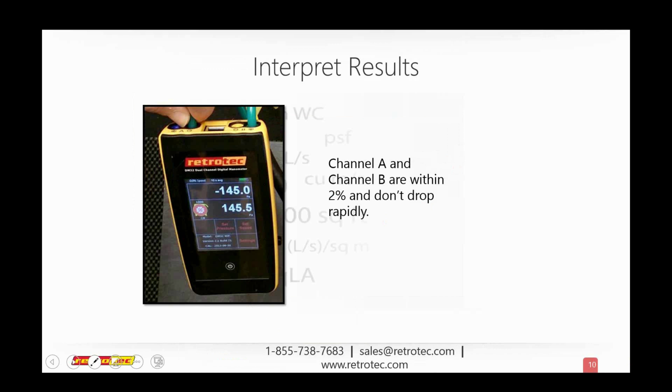Absolutely, please. One is from Michael Nelson, who is asking about an accuracy issue if I daisy chain all the interior reference tubes to one point in the building. I use the extra DM2s to verify the pressure around the enclosure. Actually, you have it a bit backwards there. What we want to do is pick up separate pressures inside the building and have the same pressure on all the gauges for outside the building. We don't want to find out how the pressures are different outside the building. We want to accumulate them all together and pull them all into one.